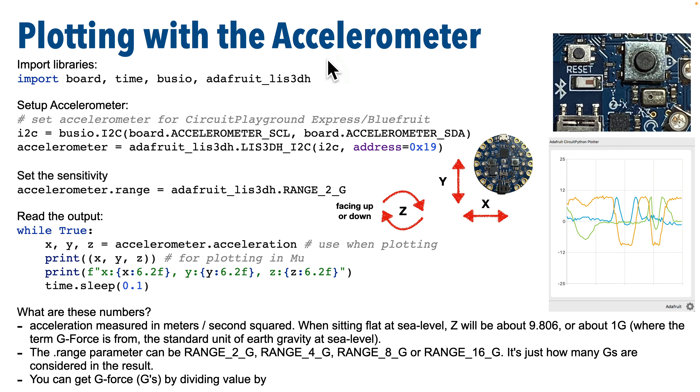This is how we set up our code. First, as we've done in other examples, we need to tell Python we need a library to work with the accelerometer. Base Python doesn't know about accelerometers, but we'll import the adafruit_LIS3DH library, and that gives us all the data structures and methods we need. We're also going to need to import busio — that's a library that allows us to set up communication with our accelerometer so we can refer to it in our code.